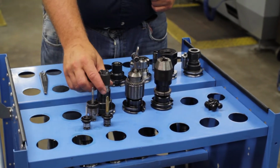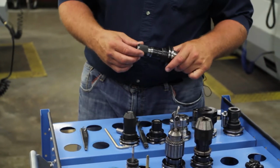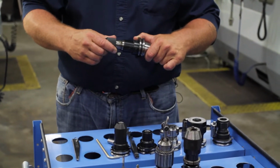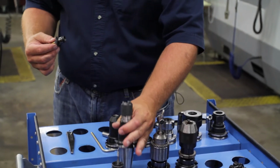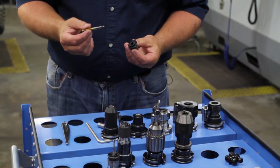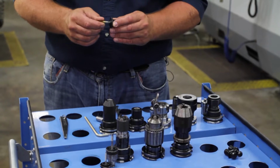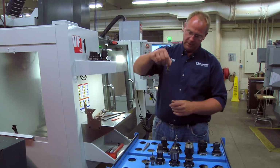And then for our taps, we like holding them in what they call floating holders. If you notice, that floats up and down, okay? There are a number of different adapters, and they have an adapter for each size of thread, or each size of tap. If you find the proper adapter, it just fits in there. It only fits in there one way. It snaps in there, okay?